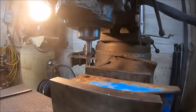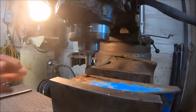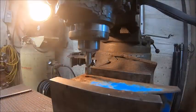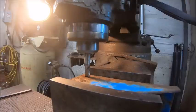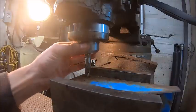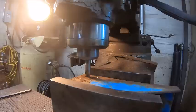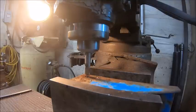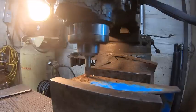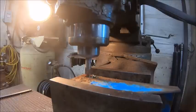because end mills, although they are incredibly strong, they are incredibly brittle. So if you can't hold the part still, you got a very good chance of chipping the mill, or just flat out breaking it off, one of the two. So I just gotta take small bites to make sure this thing doesn't grab hold and try to yank that stake out of the vise.